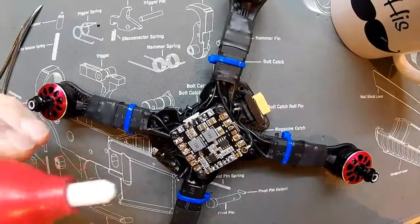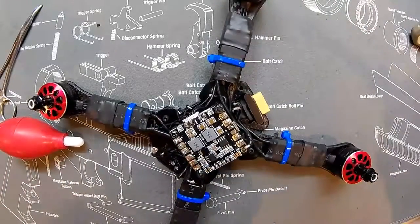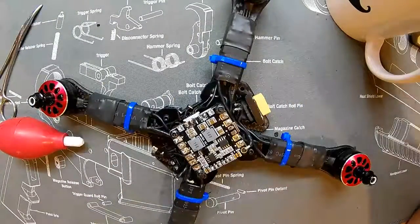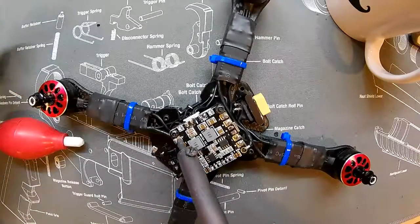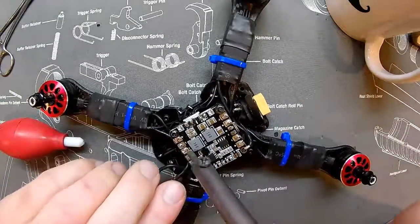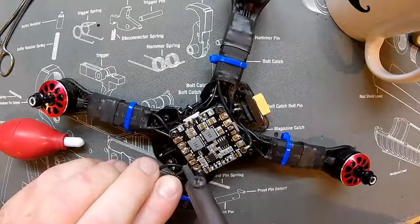Sometimes you can't get it with the sucker — you can just scrape it off with your soldering tip. And I use a coffee cup with steel wool in it to clean my tip off. Works pretty good.